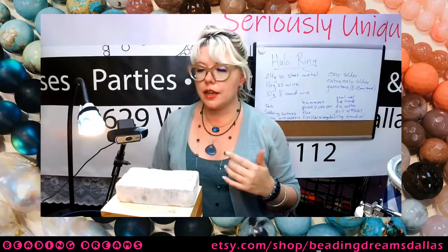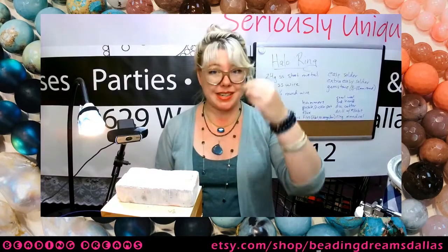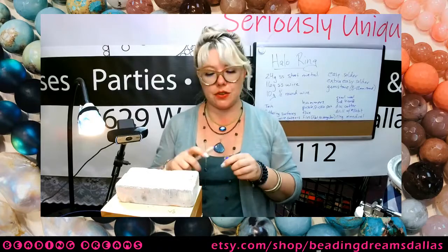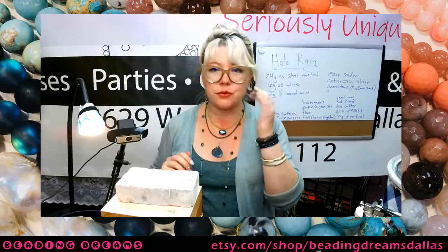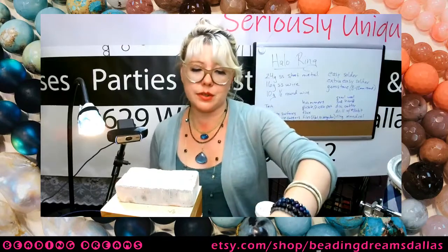Number one, you get a way better connection because you've got the actual physical connection of them going down through the disc plus the solder. Number two, so much easier to solder them. Like if you just imagine trying to hold them with the tweezers and set them on the front of the disc, it's just a recipe for disaster and frustration.